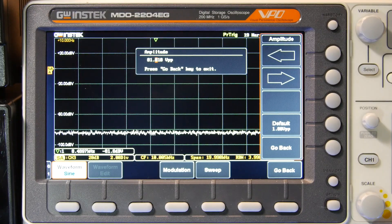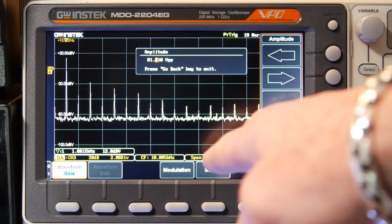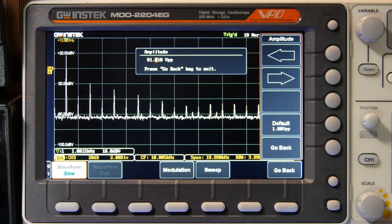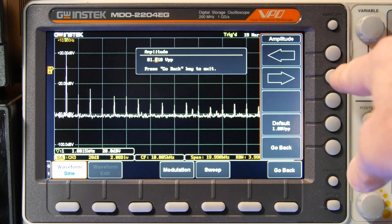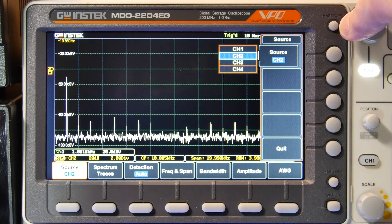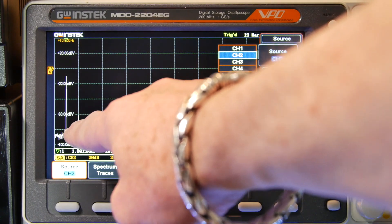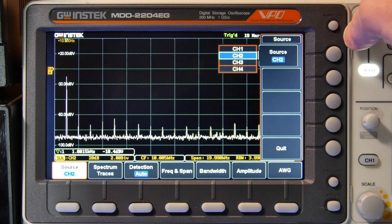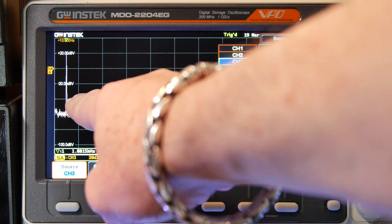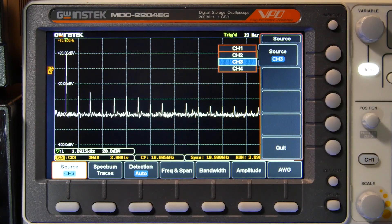I'm bringing the voltage back up. You saw that white noise floor line before with no power — now the noise floor is coming up. That's with 8 ohms. Looking at the input signal again: you see this spike at about minus 60 dB and the rest of the harmonics are down. Then on the output there's one at minus 40 dB — that one actually gets amplified a bit higher, so some of these are actually the amplifier causing it. The Keithley says we're at 0.09% distortion right now.